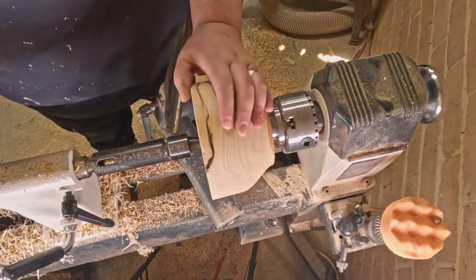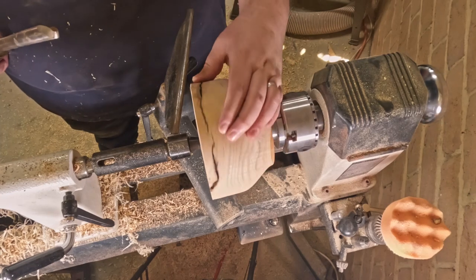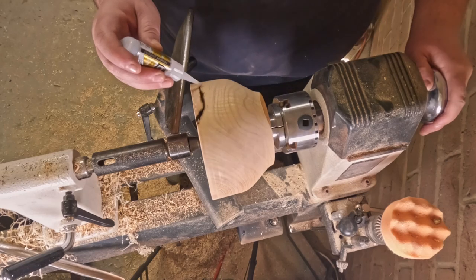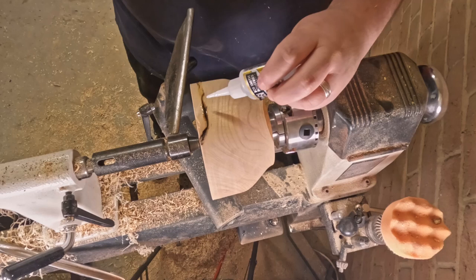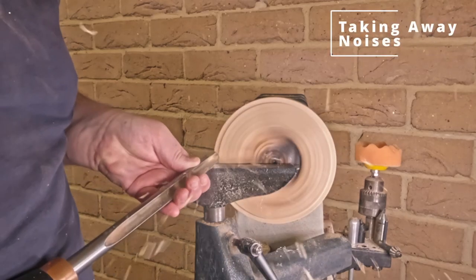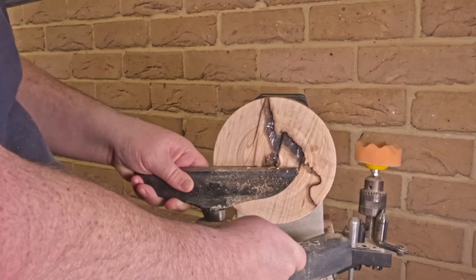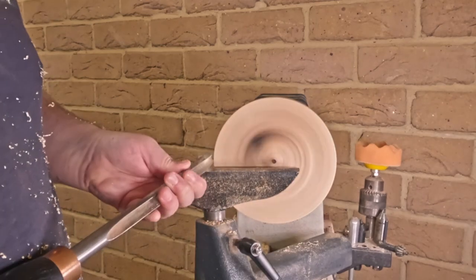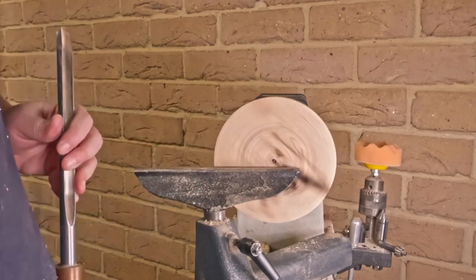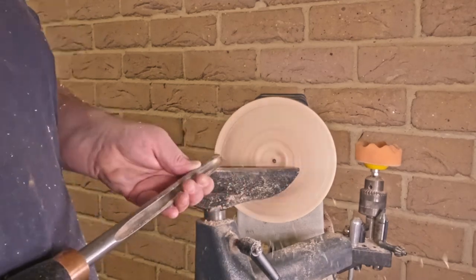There's some wild grain through this already and we haven't even got to the bowl portion yet. I've decided I'm going to try and at least glue the bases of it up and get some control back, hopefully get rid of it smoothly. The only reason I'm putting the glue is to try and solidify it — it's not to add an accent piece. Now we've flipped it around, and my main plan is to take it down and get rid of all that loose excess stuff. The noise is horrible — I'm cringing as it's turning, expecting something to come flying off. A single catch and I'm done.